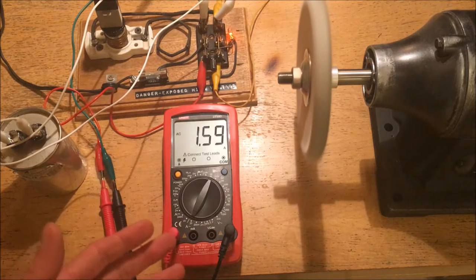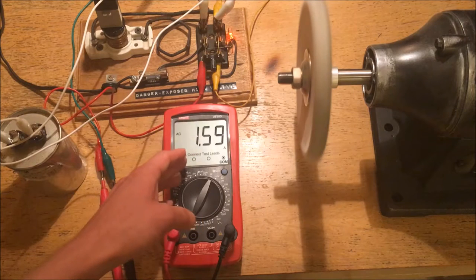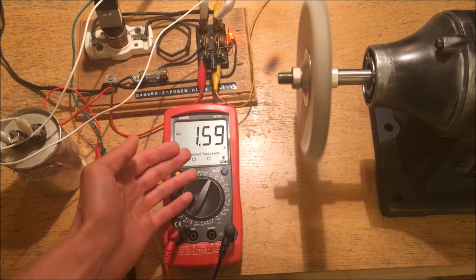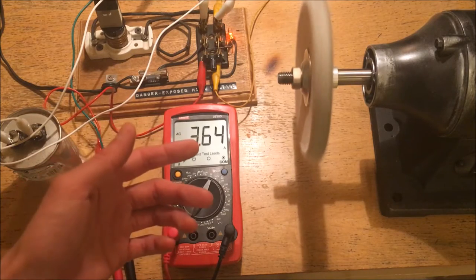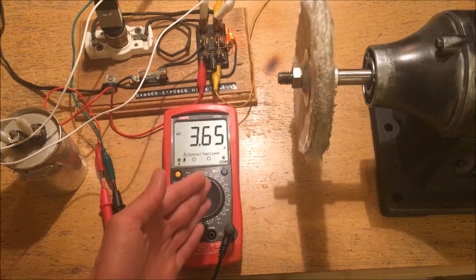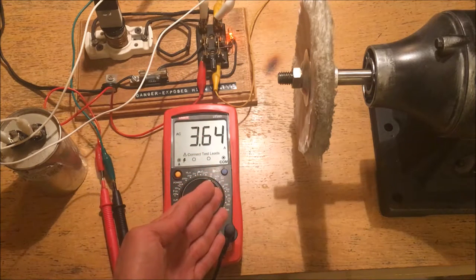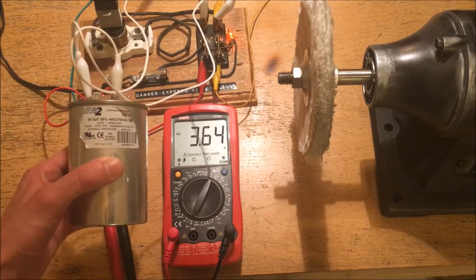In fact, let me show you an even weirder effect. I'm going to turn the motor itself off. Can you predict what's going to happen? Your intuition would probably be that this number is going to decrease because you're taking load off the system. Now the motor is off — it has stopped running and is spinning down — but it's still drawing 3.6 amps. So where is all that going? Why is something not getting super hot when 300 watts is being dissipated? Well, what's actually happening is this capacitor is acting as a reactive load in the opposite direction.